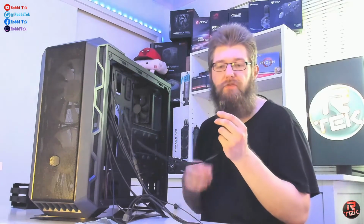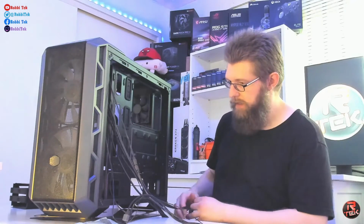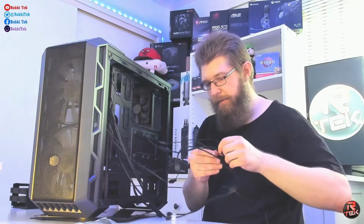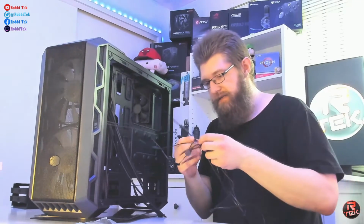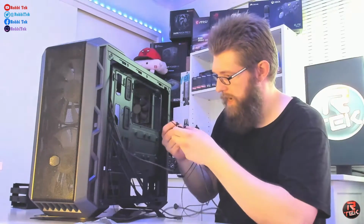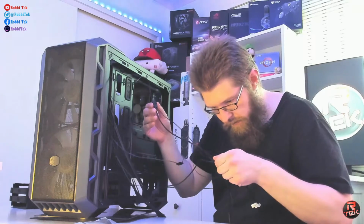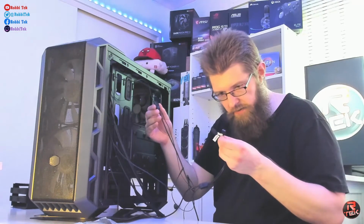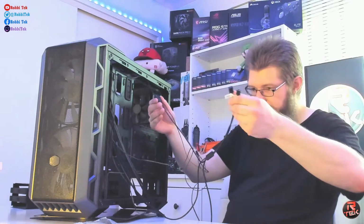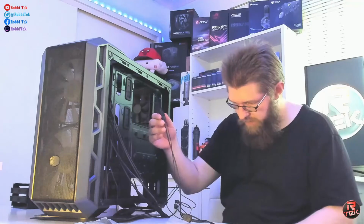Also something to note with these, try not to fondle the ink too much, especially if you're going to be using the case over and over, because you can rub that stuff off quite easily. But we'll pop that aside there, and then that leaves us with our optional RGB and fan mess. That starts to become a little tedious at times. I'll just get a visual myself on how it's actually operating. So that's for topside RGB and topside fan connection. Going to RGB, going to a CoolerMaster connection itself, which for ASRock, Asus, MSI, it'll go into the 5-volt RGB connection on the motherboard itself here. It's also got a Gigabyte variety or an ASRock, Asus, MSI variety, so 2 of them. So that's how I would see that go.